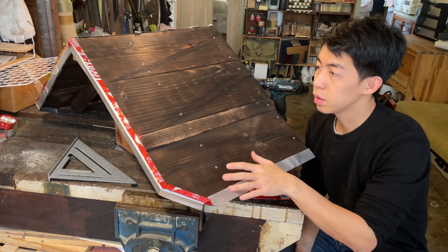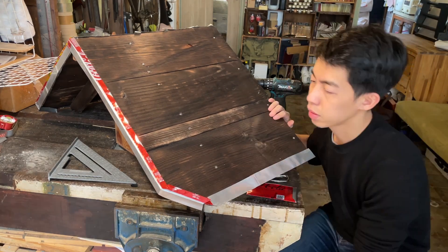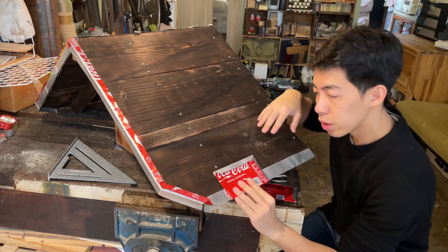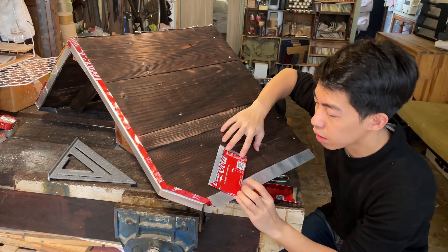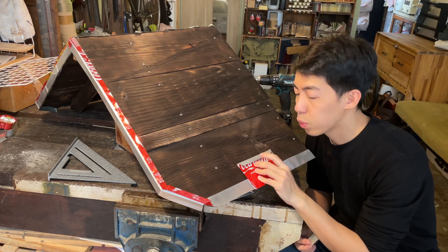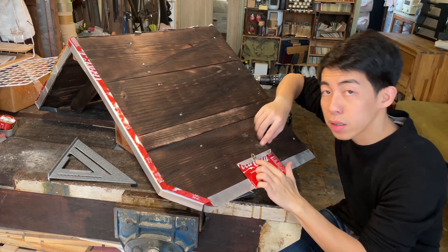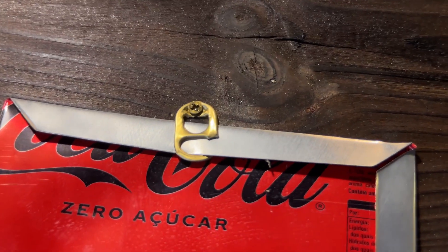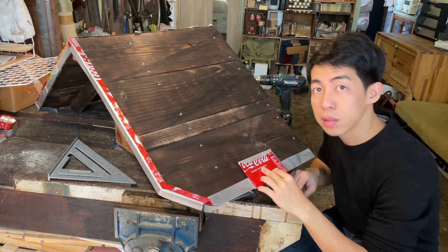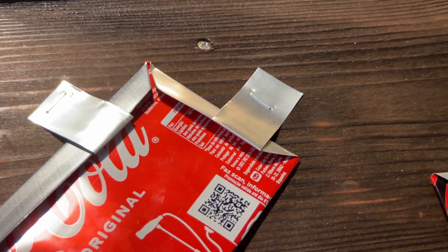The edge is attached — the main purpose of the edges is for the shingles to hold onto the surface. This time we want to try two things differently. One is the direction of the shingles: last time we did it horizontally, but this time we want to try diagonally because the water will slide off more easily, though it takes more effort to fill in the edges. The second thing is the way of securing the shingles: last time we reused the tab to hold the shingle and put a screw there, but the problem is that it creates a weak point for puncturing the shingles on top. So this time we'll use a small tab and then use a staple gun to hold it — the surface would be more flat.